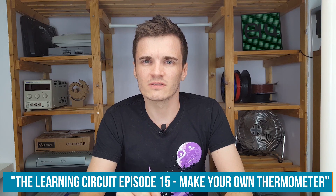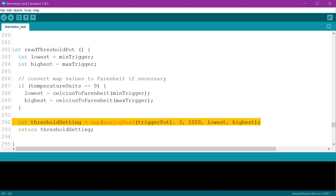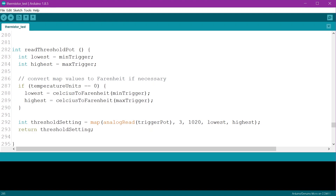The main additions are for the potentiometer and the button. You can read the position of a potentiometer in much the same way as a thermistor using an analog pin. This gives us a value between 0 when the pot is all the way to the left and 1023 when it's all the way to the right. I want to use the potentiometer to control my trigger point for the fan, but I only want it to change by about 10 or 15 degrees, so I'm going to use the map command. You give it a value to map — which is our potentiometer reading — along with its upper and lower bounds. I've used 3 and 1020 just to give a bit of room in case the pot doesn't get all the way to each extreme. Then you give it a pair of target bounds — in this case the lowest and highest that I'd ever want the trigger point to be set. So now when I turn the pot all the way to the left I'll get 20 degrees, and when it's all the way to the right I'll get 35 degrees, and I can select anything in between.